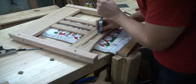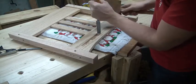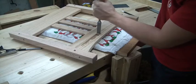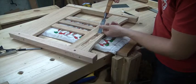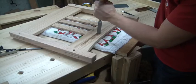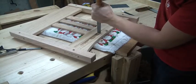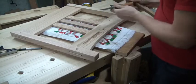Each time I go, I'm taking about a 1/16 to an 1/8 of an inch, depending upon what I feel like at the moment. Set it in there, bevel in the direction of where I'm planning to travel, and give it a couple good whacks with the mallet. And I can take out a 1/16 of an inch of that groove, and then go again. And again. Just repeat that process, on and on and on.